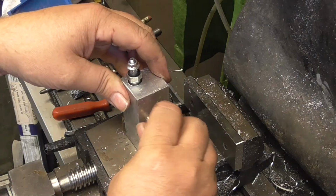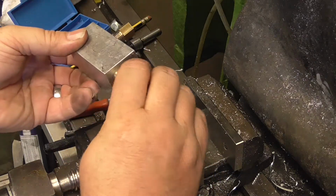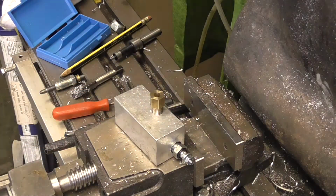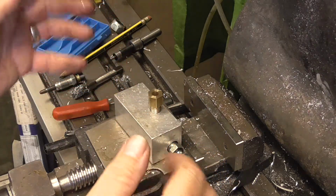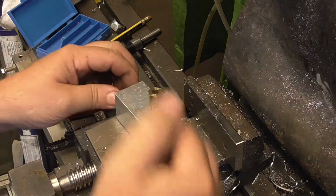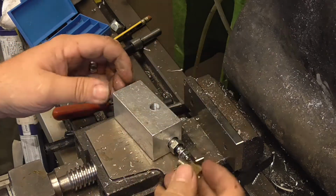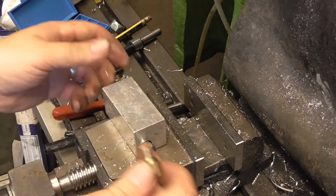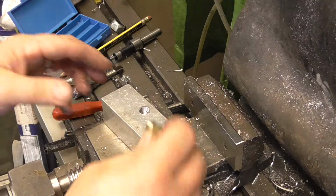So that's that part done. That one screw in there, that one screw in there. So now I'm going to put a through hole, just in case, with another glow plug hole that's not used and doesn't go into the oil gallery. So in other words, it will be just a hole straight through which these will thread into, like so. And I'll put another glow plug hole in, but it'll be a blank hole, it won't go anywhere. Just gives me two options for glow plug heating.